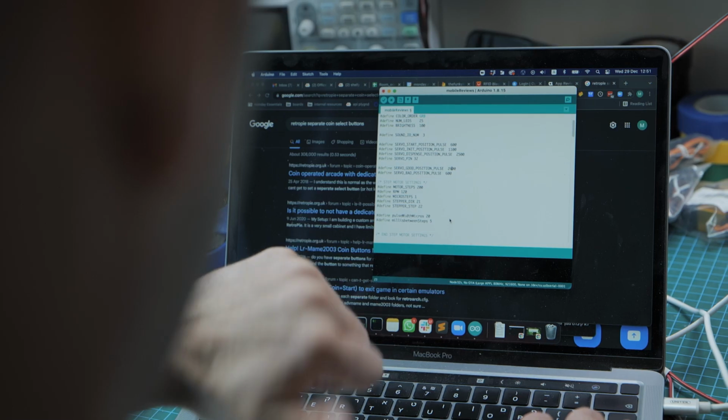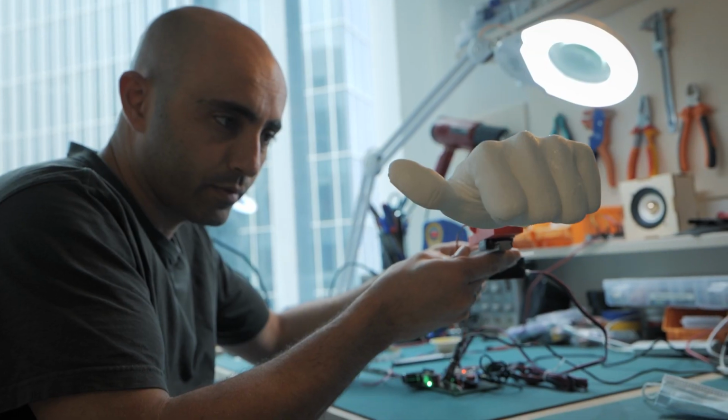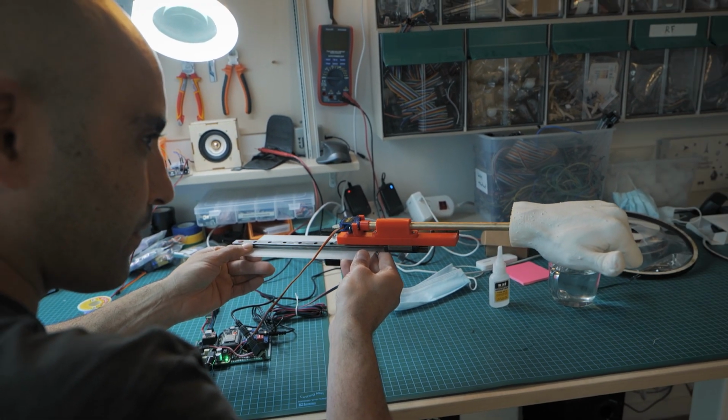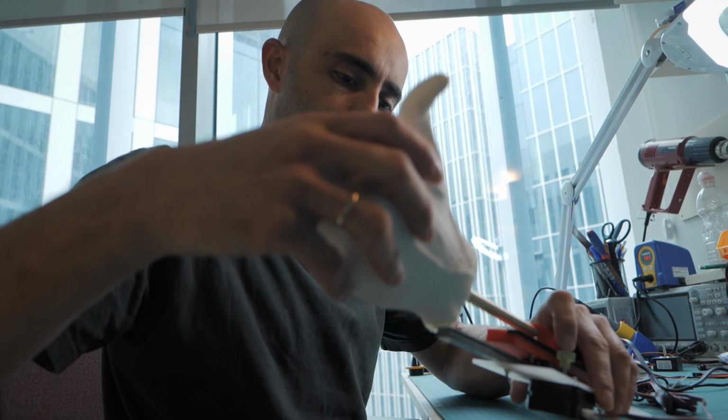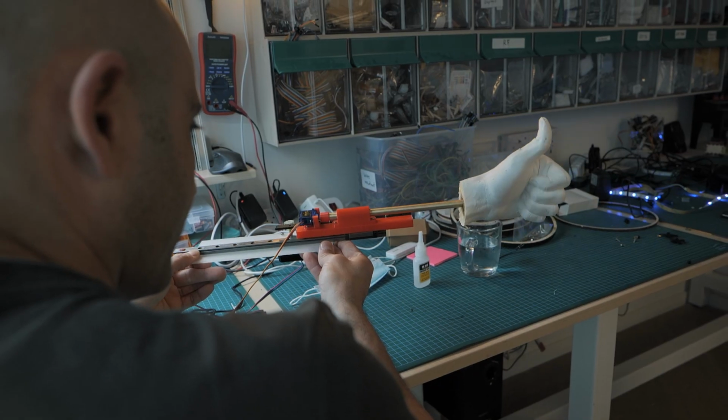After I got the prototype board assembled, I uploaded some new code and ran a few tests, and then I noticed that the servo motor wasn't working consistently. It seemed that maybe it had power issues, communication issues, or maybe it wasn't big enough for the hand's weight. Anyway, after eventually swapping out the servo motor for a bigger one, it started working perfectly. So I figured, let's just tell Drapkin that he messed up.